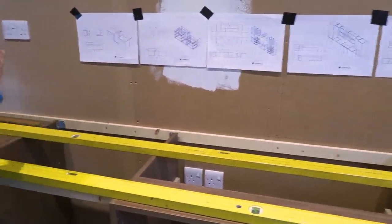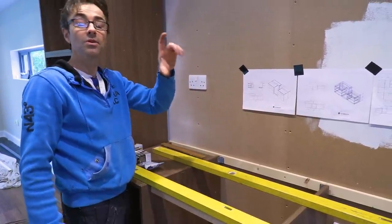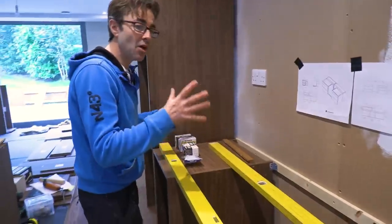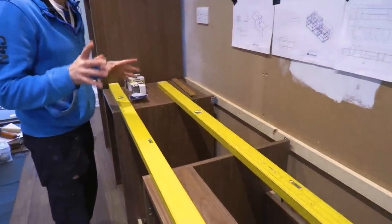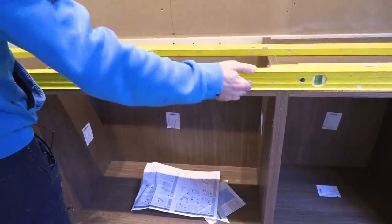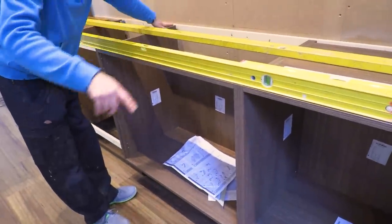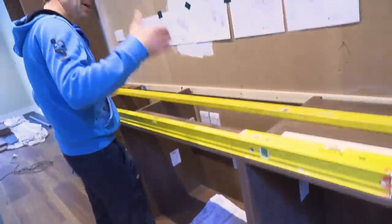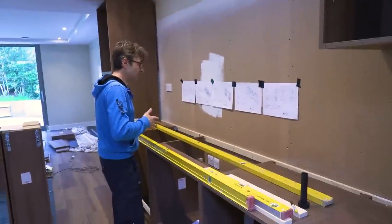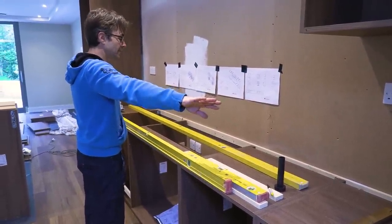The batten was put through to my level because my floor is nice and level. When I put my carcasses together, I spin them upside down, put the legs on, and set them all in my case at 155 millimeters, so when I slide the carcass in they're almost perfect — then it's a very simple method of leveling up. I started with the center unit, centered it up, leveled it through, then worked backwards and checked across the diagonals, all in relation to my datum. I add units working outward from center rather than stacking from one end.